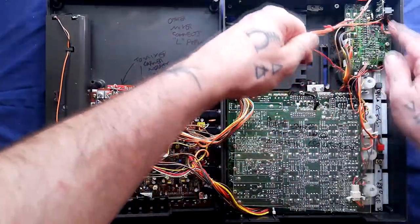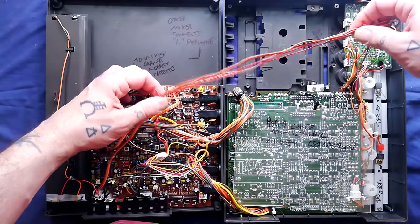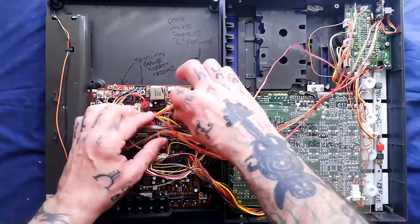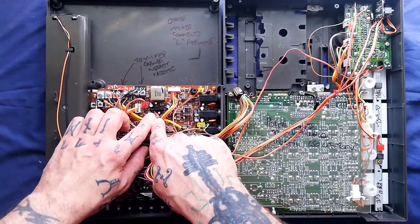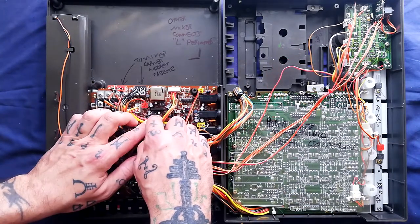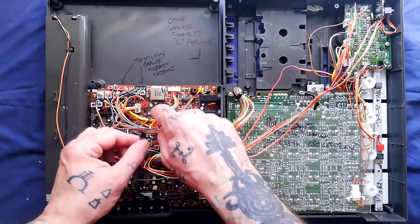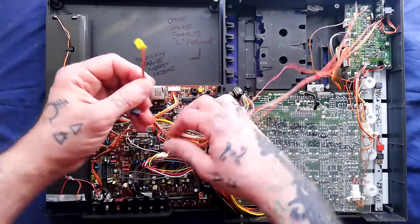There are three groups of cables. I've tied them together with cable ties; they may be tied together with zip ties on your unit. This brown and red one over here, and also this brown and red one here — they're terminating in two headers. One is immediately below this oscillator, which is the silver unit here. That header is easy to miss in reassembly because it's tucked in amongst several other black components: a transistor, some capacitors, and an op amp. But the colour of the header matches the connector. Likewise this one over here — yellow connector matching a yellow header.